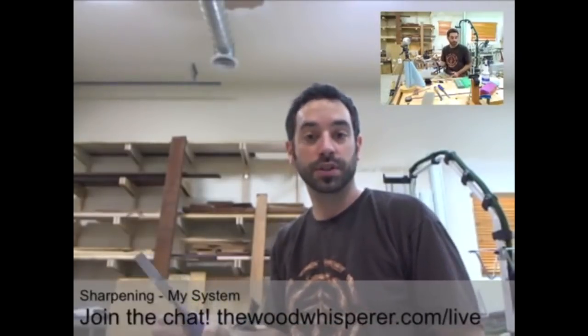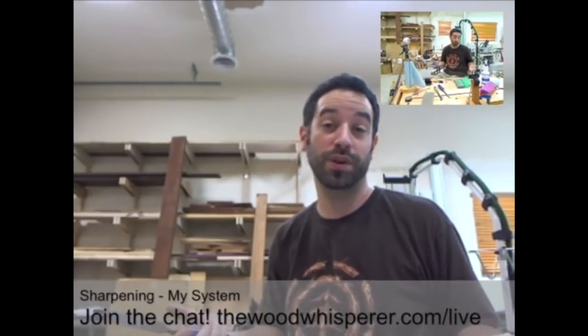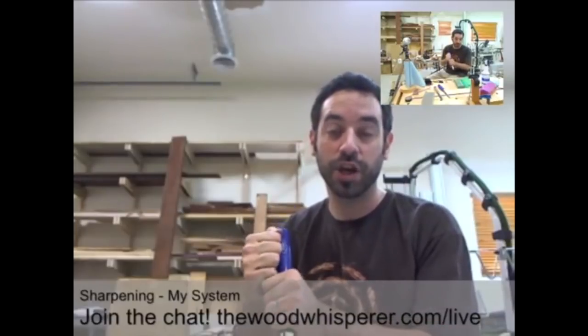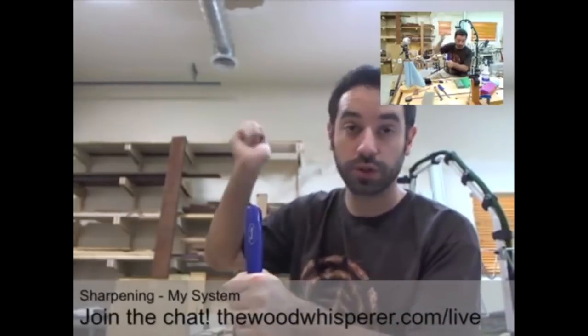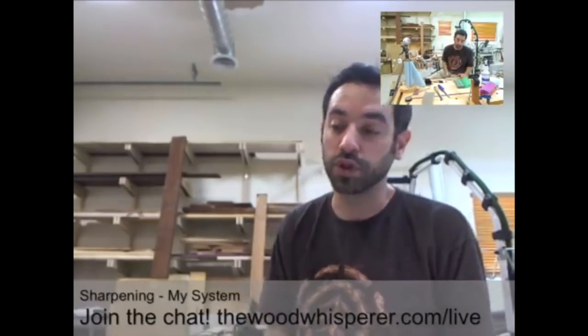You go to the opposite end of the scale, let's say you're doing mortising and you have a mortising chisel. You may go as high as 40, 45 degrees because you need a lot of material to back that edge up. You don't want it to split because you're smacking on that thing with a mallet or a hammer, and that's really a lot of torture to put a chisel through.